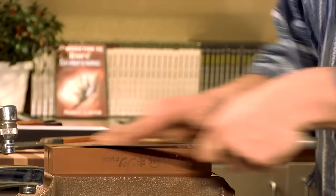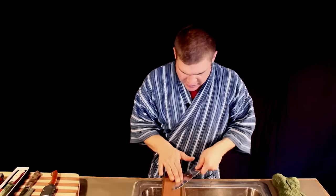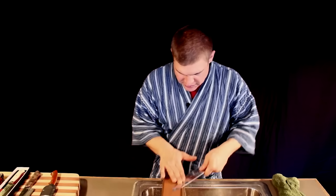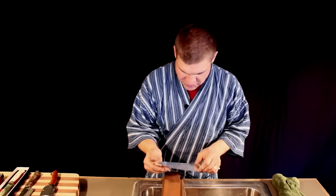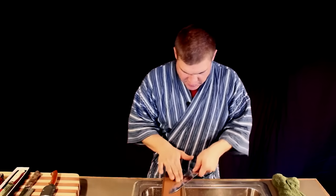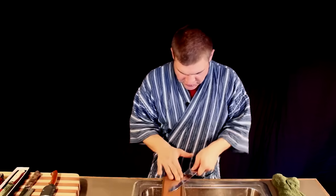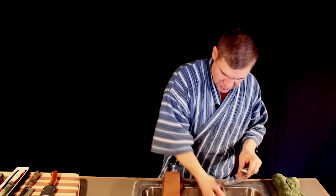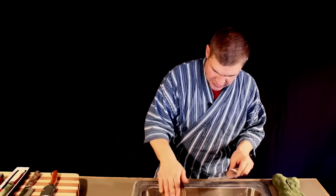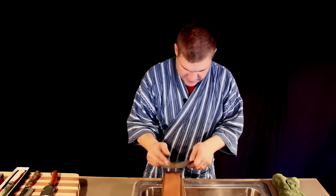You'll almost never need to do that, but it could be possible if you sharpen a knife super thin and then you wanted to, for example, cut lobster tails off with it. After you've been using a blade for slicing tomatoes, for example, you might want to go back to the stone and just beef that primary edge up a little bit. And then when you're finished cutting the lobster tails, you could go right back and thin the primary edge down again and get it ready for cutting tomatoes again.